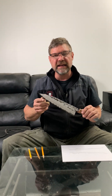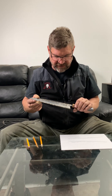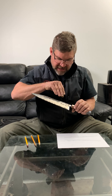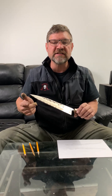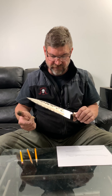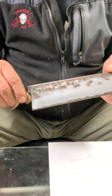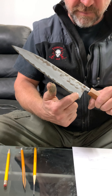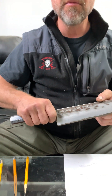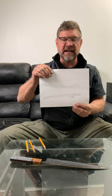This is a good illustration for how laminated knives are meant to be. I don't normally etch my stainless Fukugos I-series knives, but I did this for your benefit so you can see that 85–90% of the laminate goes down to the edge of the knife. Only enough steel core is exposed for cutting performance and a few repeated sharpenings, and you can see we have that nice balance on the other side as well. I've got a little more steel exposed at the heel on one side than the other, but you get the drift — I'm trying to help you avoid the big pitfalls like a blade that looks like that.